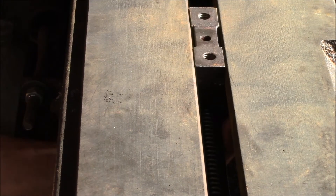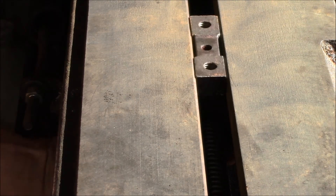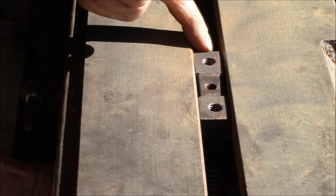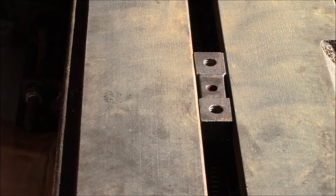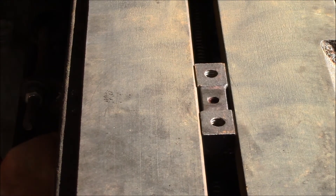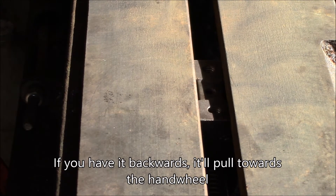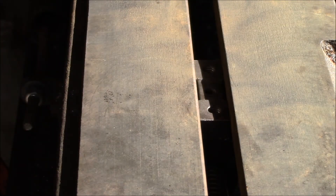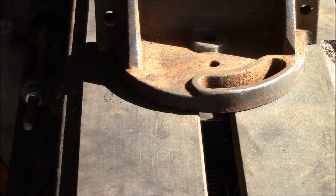Once I got it on there, here's how you check it before putting everything back together: it should slide either way freely. But then if I put pressure — pushing with my hand underneath — as soon as I turn the screw forward with a little pressure it'll push forward. That's how you test that you've got it in the right way: make sure it pushes towards the fixed jaw.